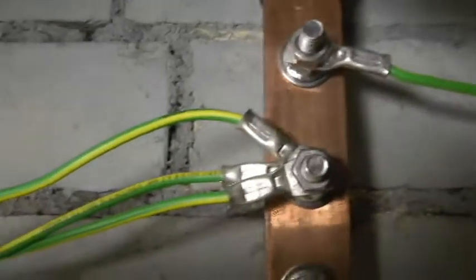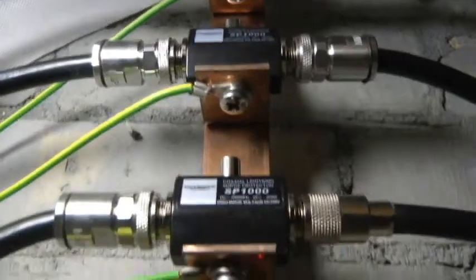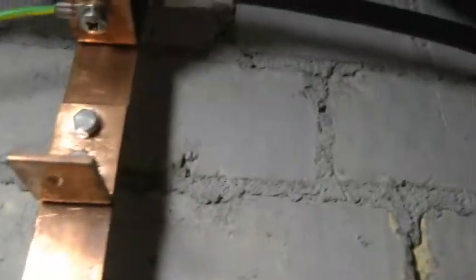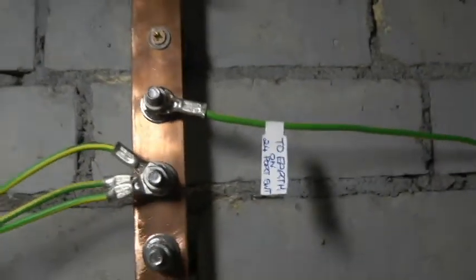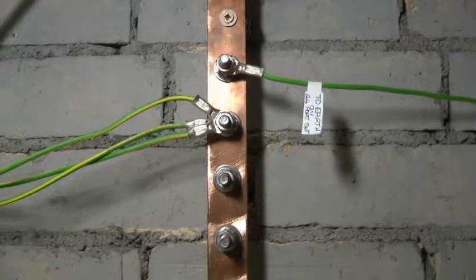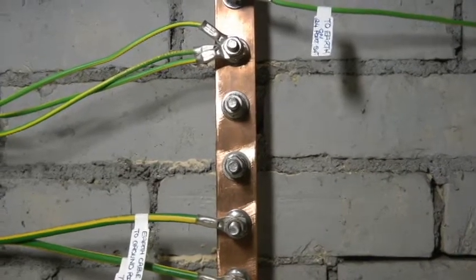I'll show you the ground rod — it's eight feet long, driven into the ground. Above that, I know it's totally overkill, but there are three earth cables going up to the bottom of the lightning arresters. I know they're already screwed to the copper earthing bar, but I'm a belt-and-braces man. One of those also goes to my network switch. I've got the option of other connections on the earth bar, so I dare say once the radio and other bits are installed we'll see more earth connections fitted.